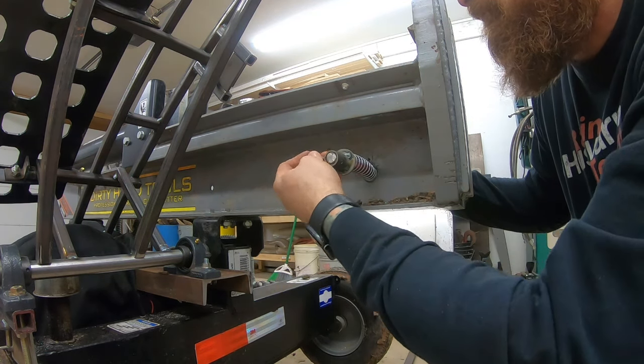Welding the brace because this is where the chain will attach down the axle to brace that up. For the piece that will pull the chain I just used some angle iron - it's basically long enough that it won't interfere with the split, and I just welded that to the wedge head. The end of the chain has just a hook so that I can unhook it, and then it will be attached at the other end and will just stay on the table.